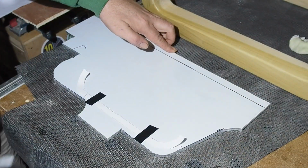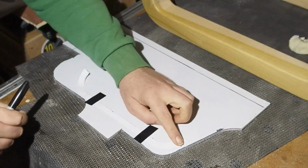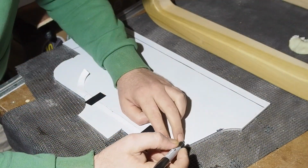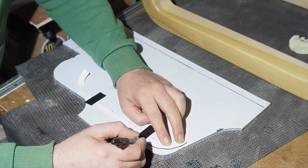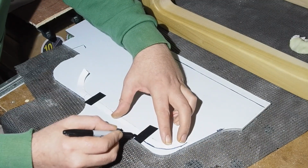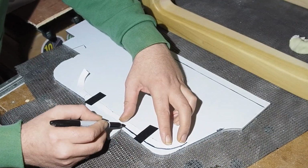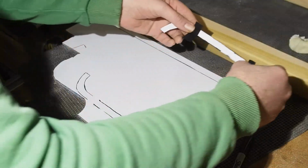Instead, to round up the build, I'll show you me making the aluminium clamp pieces for the upholstery. On finished designs and products, these are CNC'd. But on the pieces I'm still tweaking, I make them right here. 6mm alley plate with a little paper tracing of the housing I've machined in the frame. The plate comes with a white plastic protector on one side, good for marking and keeps the polished face looking nice as you work.